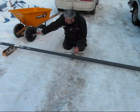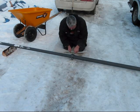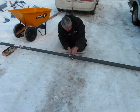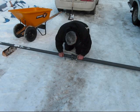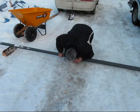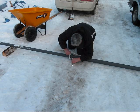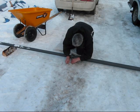We put a log here to hold the side of the tower up so we can get to all the nuts and bolts. There are six nuts and bolts per section. Just snug these down, then give them an extra quarter turn once they're snug.